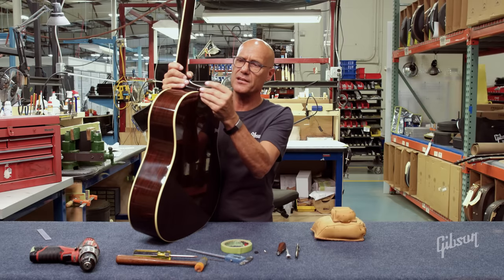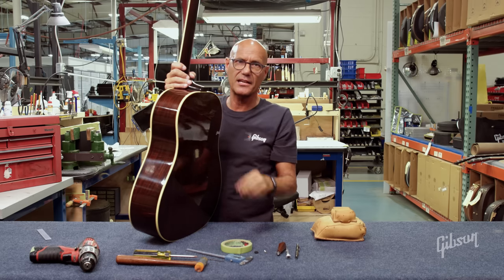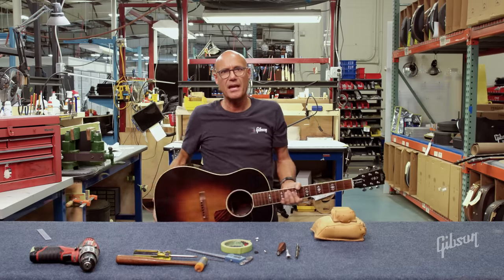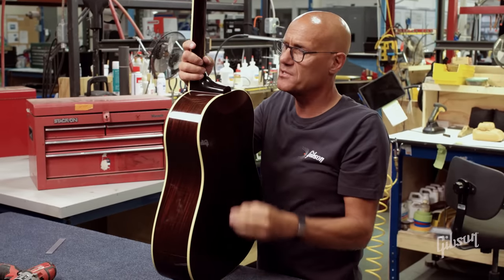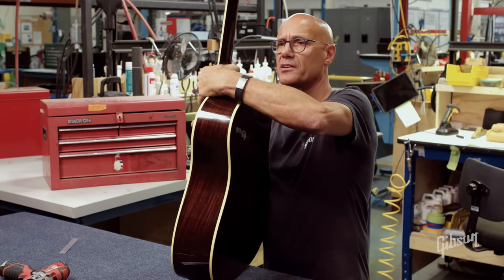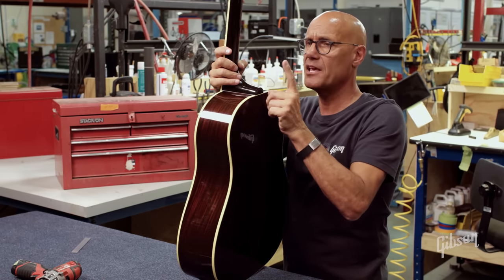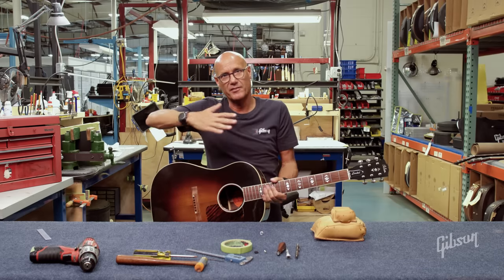On the heel end it's kind of clean because you don't see it from the front of the guitar. However, because you're going into the end grain like that, you have a greater risk of the wood splitting when you're driving the screw in, and because of the tension of the strap. Also, when you're wearing the guitar it may have a tendency to be a little bit more tippy as the strap can rotate. So in more recent times a lot of people like the strap pin mounted on the inside of the heel. You still have unobstructed access to the higher fret areas, and having it there has more structural integrity because of the direction you're drilling into the heel. It also holds the guitar more snug to your body because it's pulling across there instead of allowing it to be tippy.